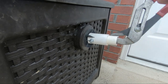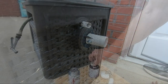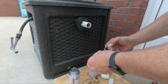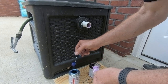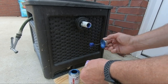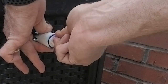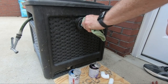Here I remove the short PVC pipe. Now I'm going to make it permanent with PVC glue. I apply some PVC primer to the coupling and to the pipe. What primer does is penetrate the PVC and allow the adhesive to bond more easily to the fittings. I apply cement to both the coupling and the pipe, then press it in and give it a little twist. I clean up the excess cement with a rag.